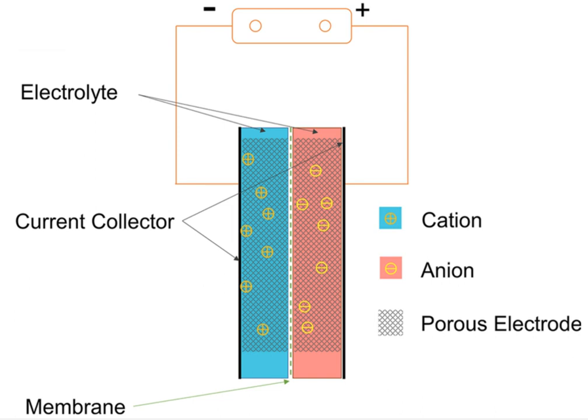For example, it was demonstrated that energy collected from RF radio frequency fields using an RF antenna and an appropriate rectifier circuit can be stored in a printed supercapacitor. The harvested energy was then used to power an application-specific integrated circuit for over 10 hours.